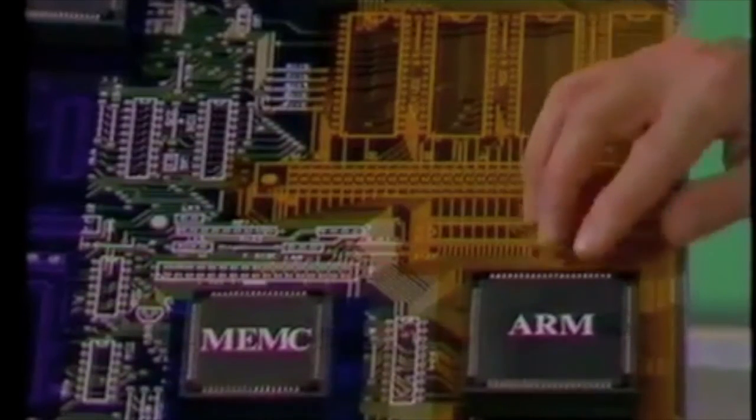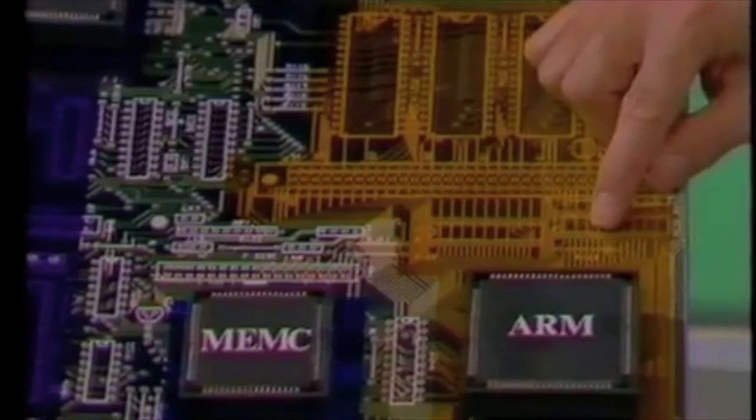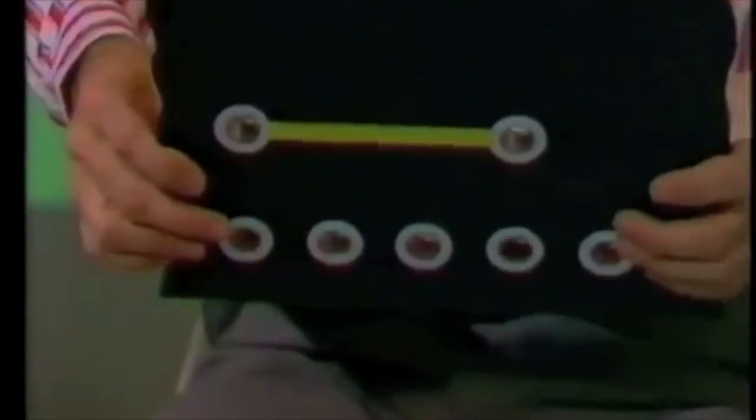This is a full 32-bit machine, which means there's a good deal of information to be moved about. There are 32 separate signals coming in and out of the ARM chip, so we need 32 tracks for the data bus. There's also a 26-bit address bus, which means the chip can address 64 megabytes of memory. All those connections make for a pretty complicated circuit board — a conventional double-sided PCB would have been unacceptably large, which is why Acorn went for a four-layer board. There are tracks on the top and the bottom, plus two other layers sandwiched in between that carry the power supplies. The connections between layers are made by through-hole plating.